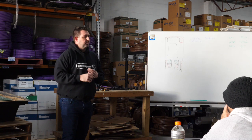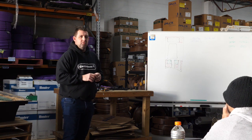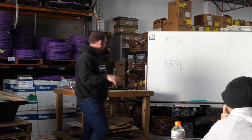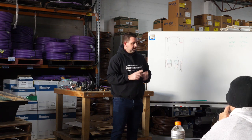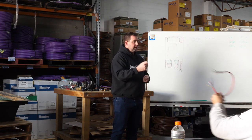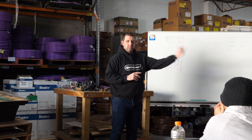Once you're getting out to 120 metres, you're starting to push it - the next size up is one mil. For you guys, you'll only be using that if you've got a job at Hahndorf and you're doing an acre. We'll help you size that - it's more just understanding it. Like most things you won't know, you can come and ask us. It's important that you go home knowing you need to ask those questions, like how far the furthest solenoid valve is going to be from the controller.